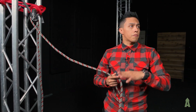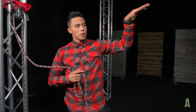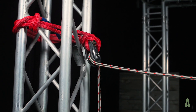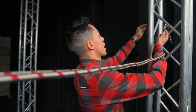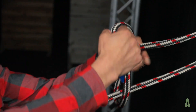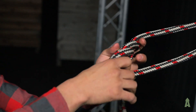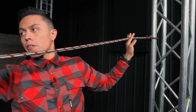We're going to start and look for a suitable anchor parallel to this. Now we're going to go to our secondary anchor point, which is parallel to our primary and is suitable to handle the load that we are going to be applying. What I'm going to do here is just lock this section off with a running bowline, or whatever knot you choose to anchor.